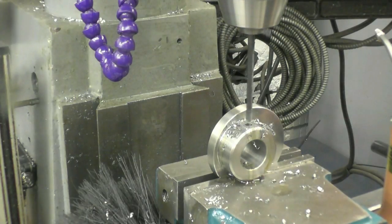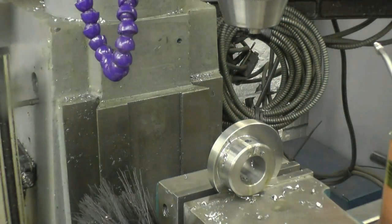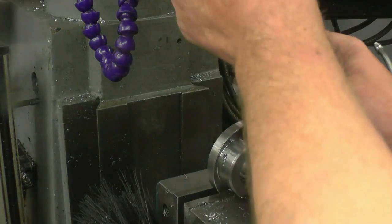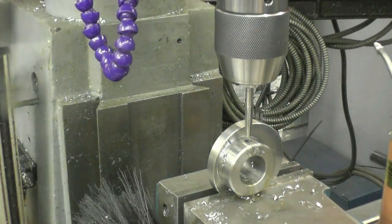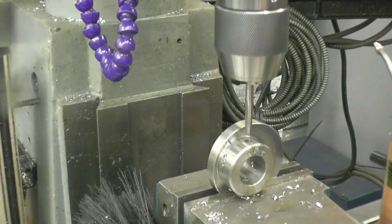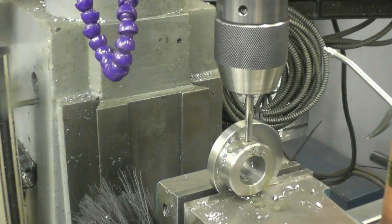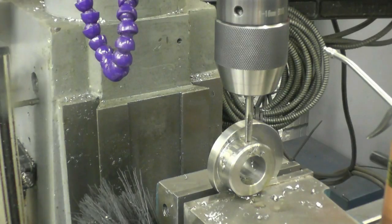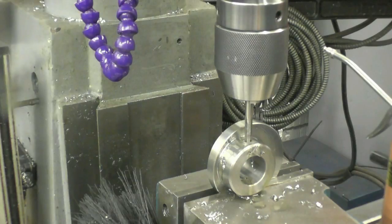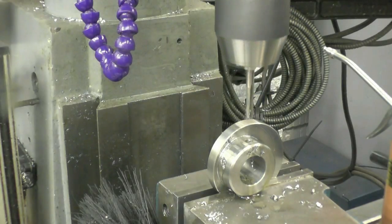Hey, that's through. Right, these BSF taps, I've got those quite reasonable, and this has got a jog facility on it, so I'm wondering whether I should try tapping it using the machine. Right, we'll give it a try. It's certainly started.